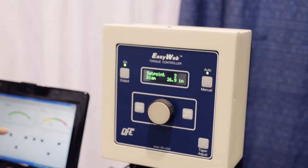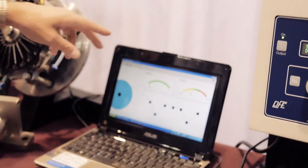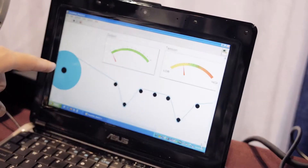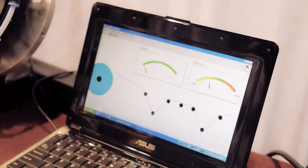We're taking the diameter input through line speed tach and roll speed tach — the ratio of the two. As the roll diminishes in size, the tension is increasing on the line, but our torque controller is reducing torque to keep tension in the safe zone and fairly consistent.